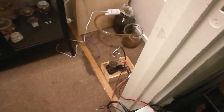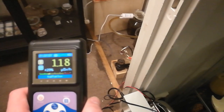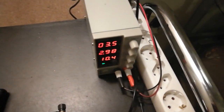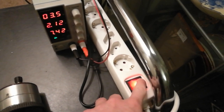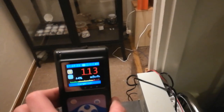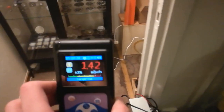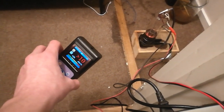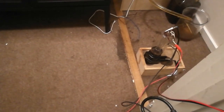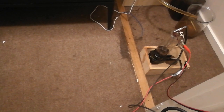Here's the radioscanner, and there's the tube. Let's check how much backscatter is coming in the operating table's direction — I'm still sitting behind the glass wall door. Turning on the filament, checking if it's glowing — seems like it. Turning on the high voltage. Let's check the radioscanner. Yeah, look at that — that's a pretty intense backscatter reading! Yeah, that's quite scary — you don't want that. It's a pretty dangerous thing: a lot of backscatter, and a lot probably can't even be measured by the detector itself as it has such low energy.